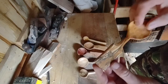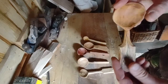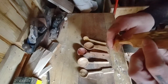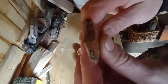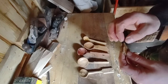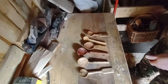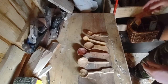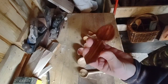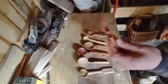There's alder — that's another Birkavik spoon in spalted alder, and another in common alder. Close-grained woods are what you want — the grain going up the wood is like little straws and you want them as tight and close-packed together as possible. Some people say ash is good for carving spoons — I personally don't like it. Here's a cherry plum one I finished today, a Swedish-influenced eating spoon — quite like doing those, they're a bit of fun.